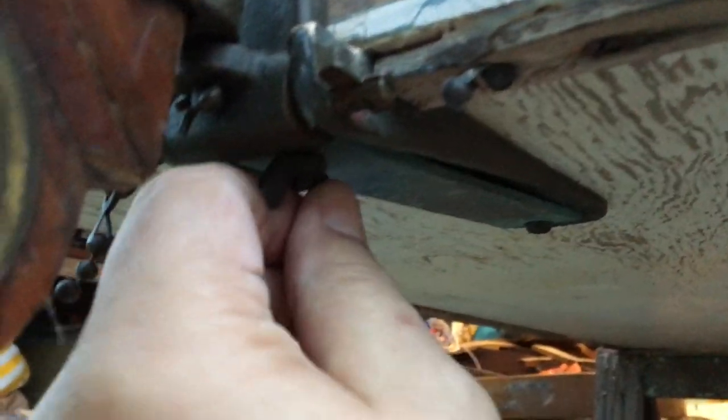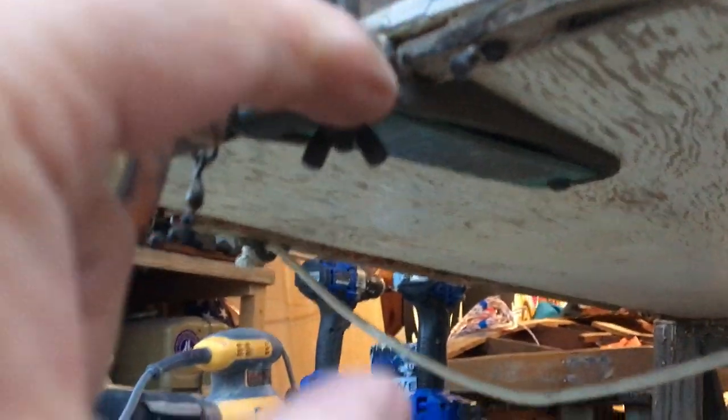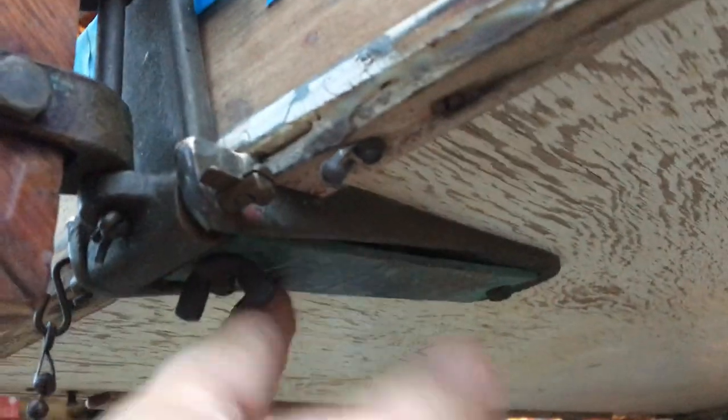There's the little bottom part of the vertical plate that goes into the depression and the latch plate there. So if you're out sailing, you can just push on the tiller and push it back in and engage it. In windy situations you want to come down here and put a couple more turns on that — that's shortening that carriage bolt, pulling it down on this piece of metal here, this spring. You can actually kind of see the bend in it right there, keeping everything tight.